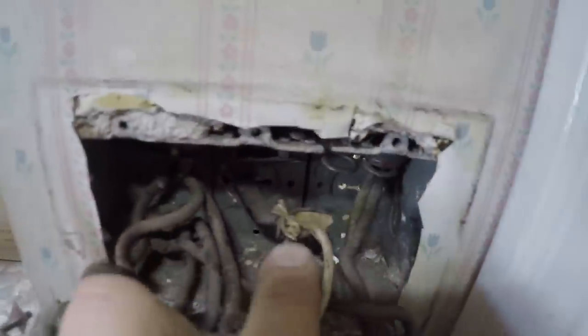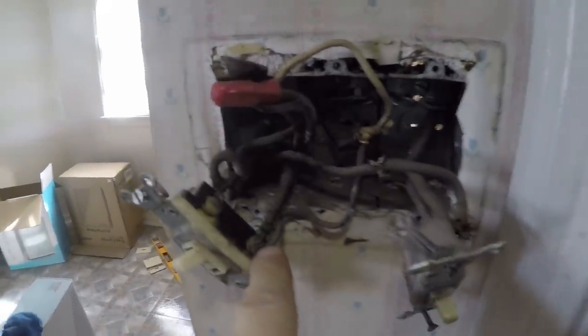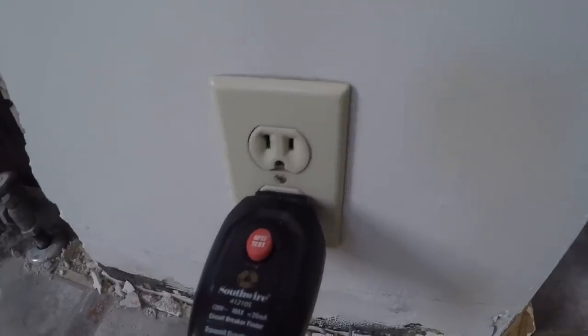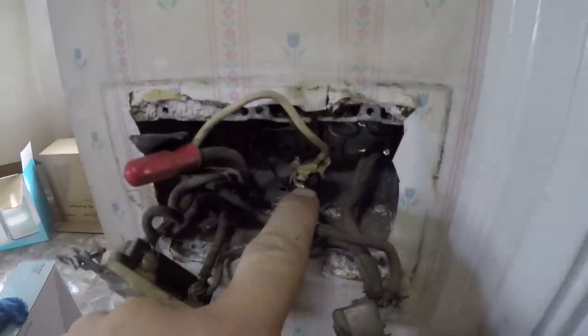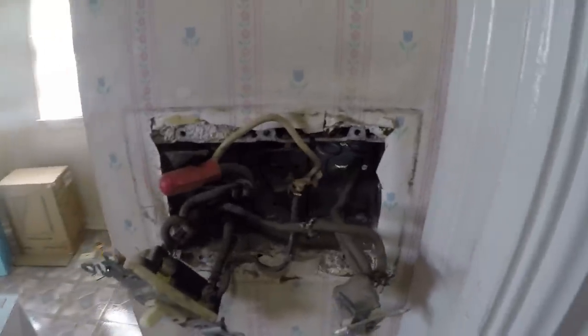So this newer wire, that black one right there — see it picks up a neutral here and then picks up a hot right here on this three-way switch, and the ground is just cut off. Since this is the older electric, the box and all that metal flex is the ground — it still works. But when you go and do this type of stuff, this outlet here has got a ground prong on it, but it's useless, it doesn't do anything. At the very minimum, if you have this mess in your house, you can at least tie that ground into this metal box — pick a screw hole, get it wrapped around a screw screwed to the metal box — so that it has some route back to the panel into the ground.